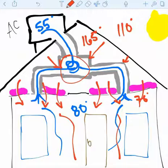So there are leaks in the thermal envelope, and we want to be able to go in and address those. Additionally, most of the homes here in Arizona were built prior to any actual energy codes. And so a lot of times we get up in the attic and we find that the insulation levels range, believe it or not, there are plenty of attics we get into where there's actually zero insulation.